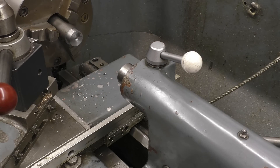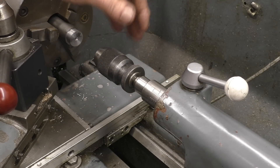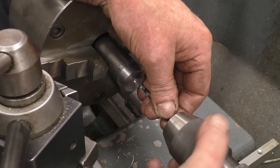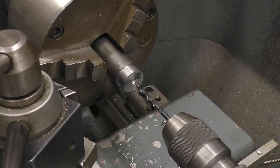Next I'm going to put in a small chuck — that's all it takes to lock it into the taper. We'll put a drill in there and carry on drilling the hole. Basically the same rule applies to drilling holes on a lathe as it does on a drill press: the smaller the drill, the faster you go.